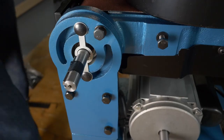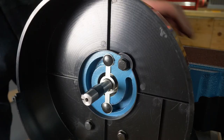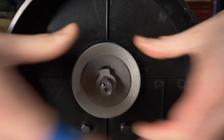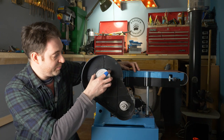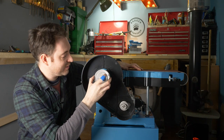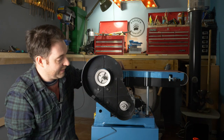This plastic belt guard needs to be installed — the bolts and washers are already on the machine so they need taking off, then it can go on and the bolts and washers can go back in. It has two pulleys and they need lining up with the keys, pushing into place, and then the grub screws can be tightened up. I've made my first mistake — I put the pulleys on so the grub screws are at the front, but pushed all the way back it rubs on the casing. Looking at the diagram again, it should go on the other way with the grub screws at the back, and that must be why they give you this really long allen key so you can get down there. So swap these round.